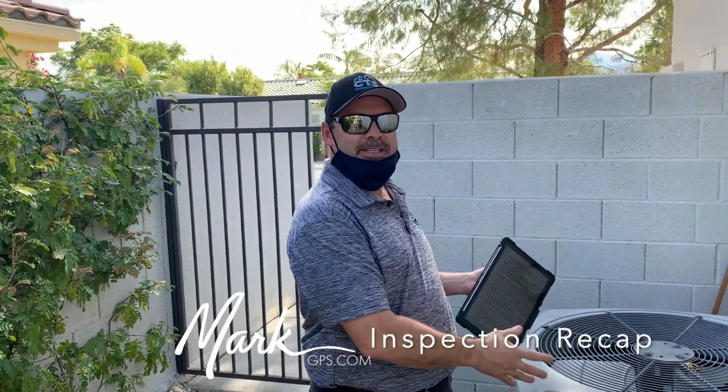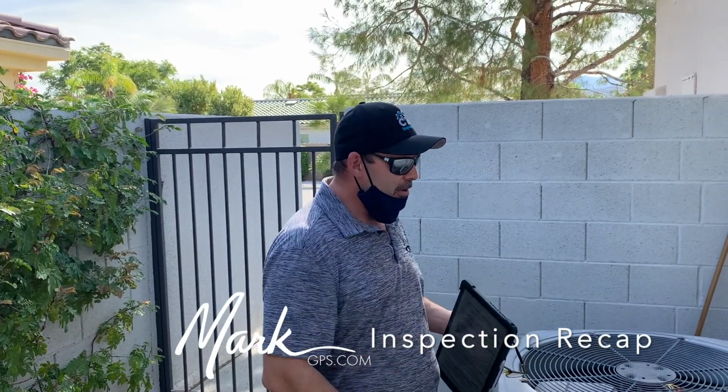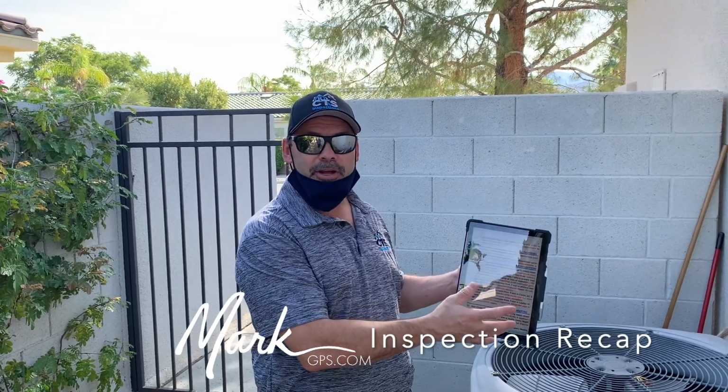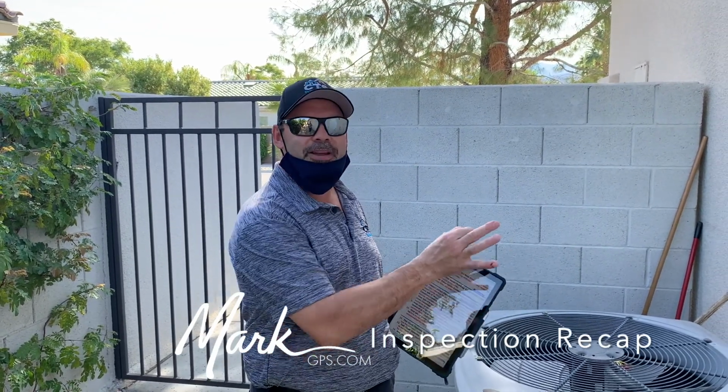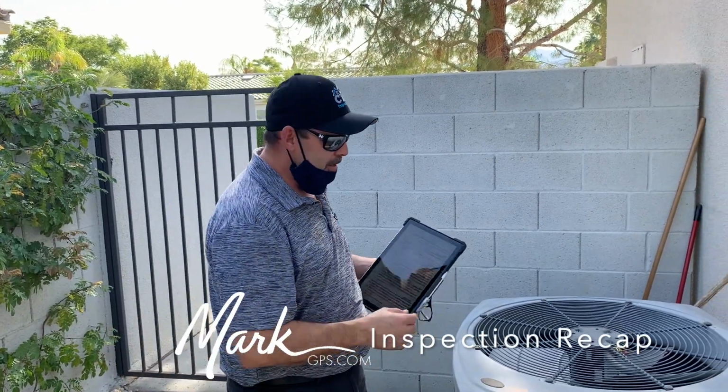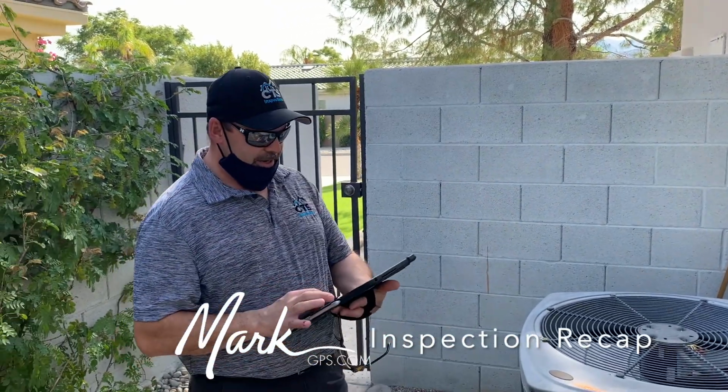It's a 2006 model, so in the event that you ever call the home warranty company because it's blowing hot air, that would be a reason why they would deny the claim, even though it has nothing to do with why it's blowing hot air. So we just need to put in some 35 amp barrel fuses. Oh, which I could probably get from Home Depot if I really wanted to. Oh, okay. Yep. So that's all we got going on with that air conditioner here.